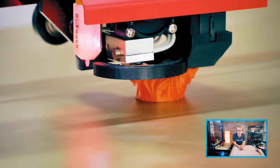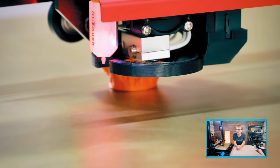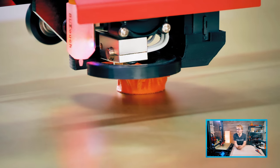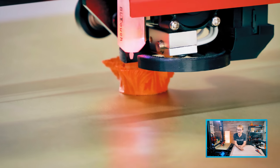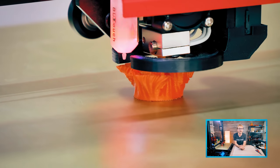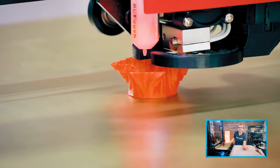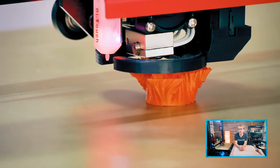Yeah. So Scott mentioned he hasn't found the download page for Raptor 2 configs for Marlin, so it's looking like they obviously do use the Marlin firmware on this printer. But a requirement for using open source software and open source designs is to publish the modifications that you make to that software. So technically they would be required to release the config files for this printer. I will need to ask them about that, because you're not getting much out of the configs, right? It's not like they're changing or improving the firmware like Creality did with their SD card power fail functionality, which eventually I think did get published, and Creality did comply pretty well there. But a standard printer config is like, okay, steps, you get a PID profile, and that's really all there is to a printer. Maybe the light is an M42 command. Though I did see that the LCD does give you an option to turn the light on and off.